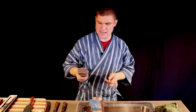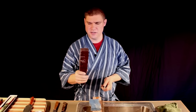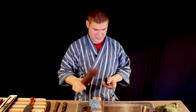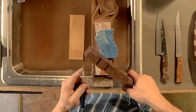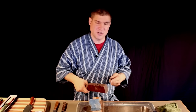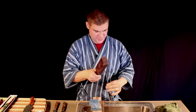Now this is kind of an advanced technique, but I have here what's called my straightening block. You could use something like oak or hickory, a strong wood. This happens to be an extra large chunk of micarta, which is an industrial material that basically consists of plastic and fiber. You would put your blade in right where the worst part is, and tweak it like this a little bit at a time, continually checking to see if you're making any progress. And you might want to wear safety glasses if you're pushing really hard on a homogeneous blade, or look away as you do it.